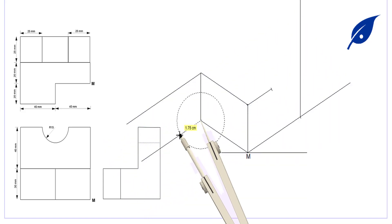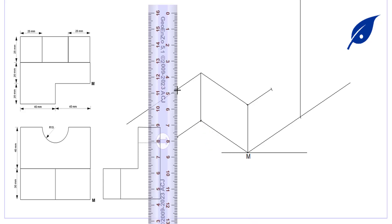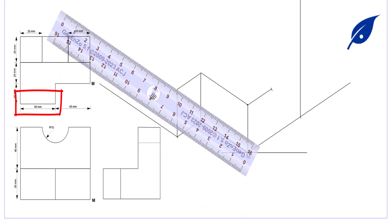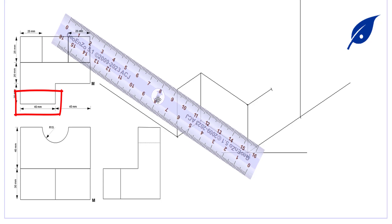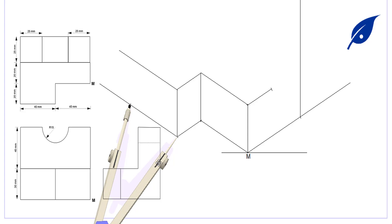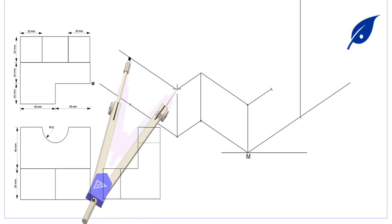The distance this way is 20 millimeters. We measure that, then draw vertical lines and connect the upper part. We erase the unnecessary lines, then project again to the other side, which is 40 millimeters. After projecting the base and the top, we get the length of 40 millimeters and connect the base point to the top point to get that particular side.